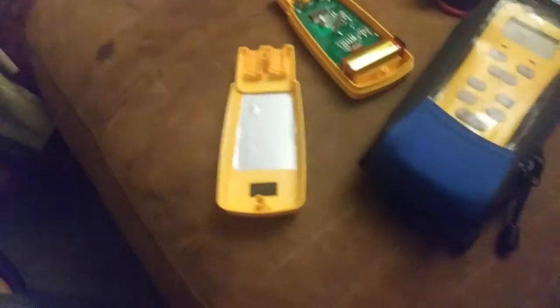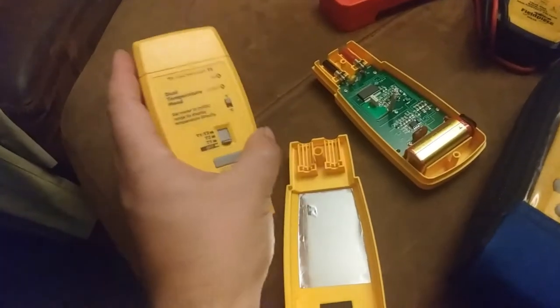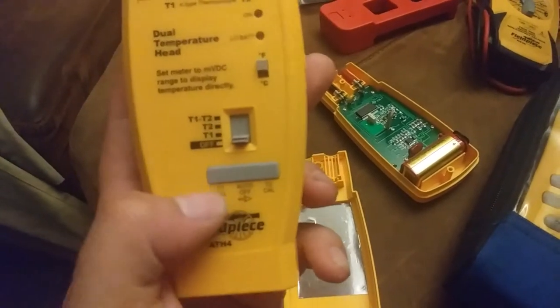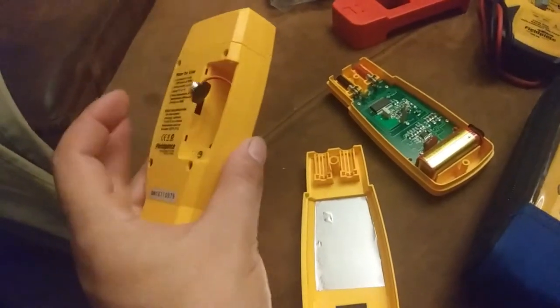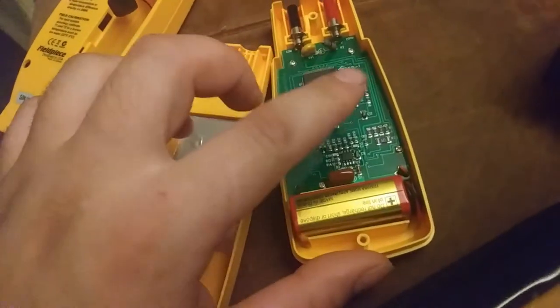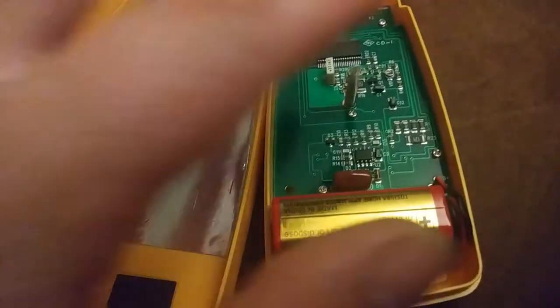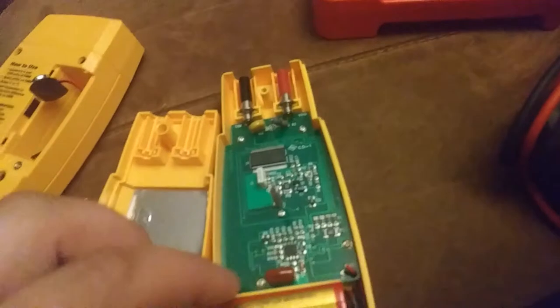Because these tools are new to me, I'm going to give them an accuracy test and presumably adjust the calibration screws. All the accessory heads take nine-volt batteries, as does the meter itself. I opened up the electronic handle to do so and noticed something interesting: a little spring that appears to be soldered down to the circuit board, and a metallic film on the back — some kind of ground reference, perhaps.